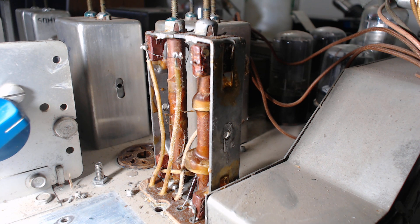These capacitors are mica and they're 75 years old. The silver plating between the plates of the mica turns jet black because silver oxidizes, and the black soot — silver oxide — slowly works its way down to the edges and shorts the capacitor out. When the capacitor gets shorted out, you lose sensitivity on the radio, or it may just stop working entirely.